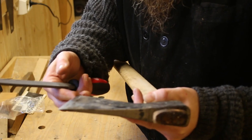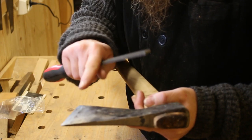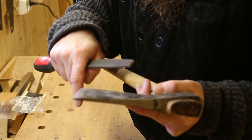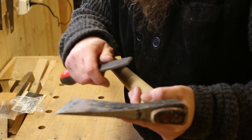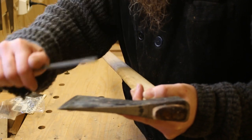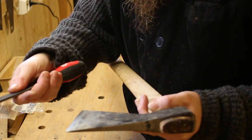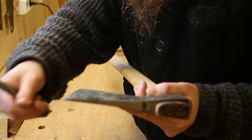As before, I looked at Ben Scott's YouTube channel. He's talking about a 15 degree bevel and then a 20 degree micro bevel just on the edge. I don't measure my bevels, but I try to follow that principle somewhat. Make it really flat and do a small micro bevel. Should probably have a fine cut file for that, but I will probably just use grinding stones for it instead.